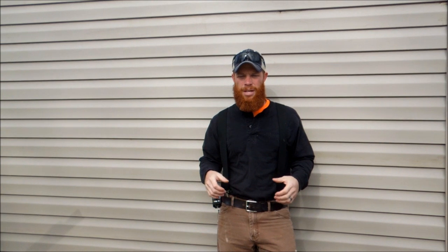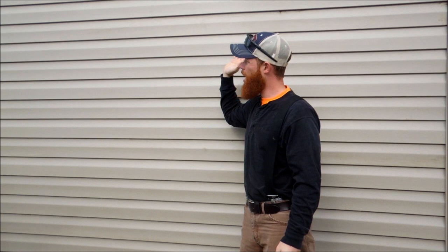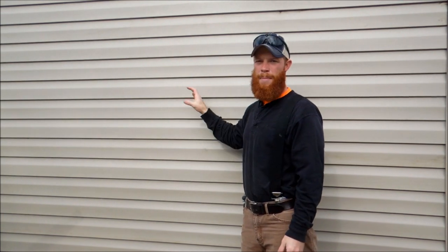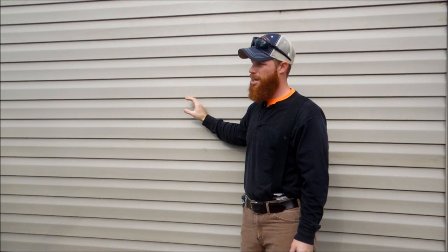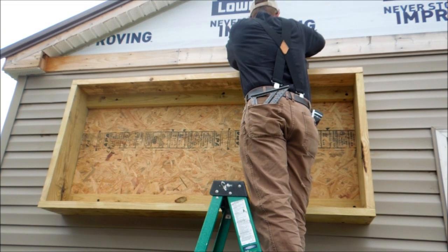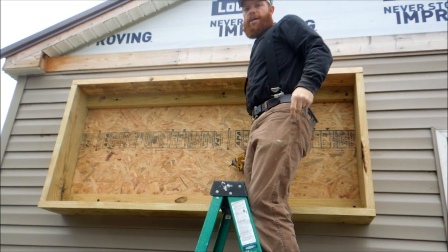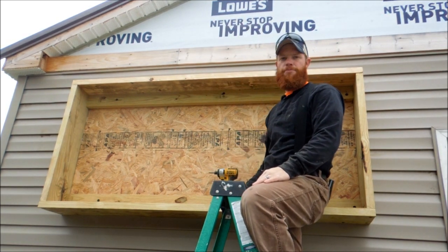Based on the knowledge I have in construction, that's what I'm going to base my build on. The first thing I need to do is get some mounting boards up on the wall — I'm going to use some two-by-fours and run them horizontally to mount everything to. I'll go ahead and lay it out, cut and mount those, and then we'll start building our box. I just finished putting the last screw in our rough frame box.